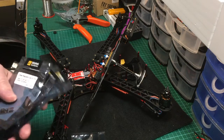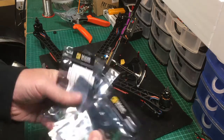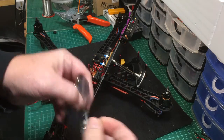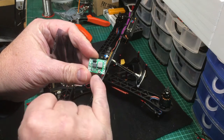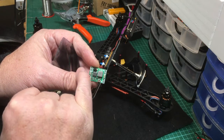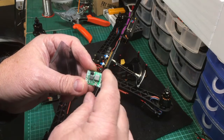When converting your 14 volts to 12 volts, you need a little regulator circuit. There are lots on the market and I've got various different types. This popular one has a little pot you can turn to adjust the voltage. Before you connect it up, you need to power it up and adjust that pot to get the desired voltage on the output. If you plug in a 3S battery, you're going to get 11 or 10 volts out.